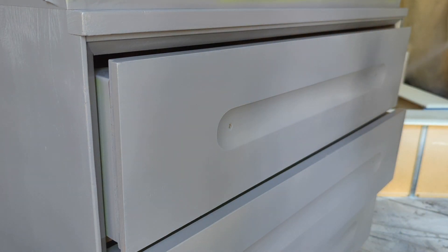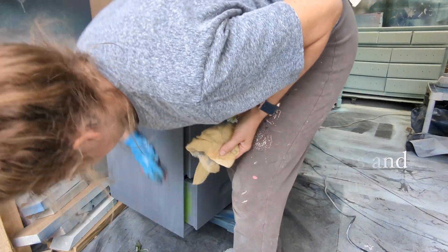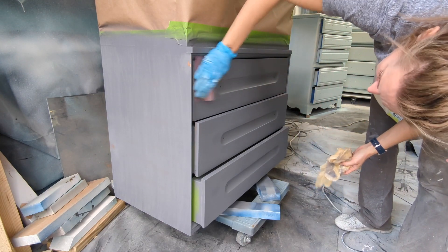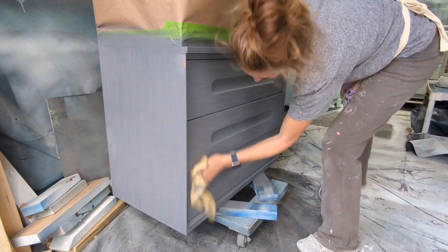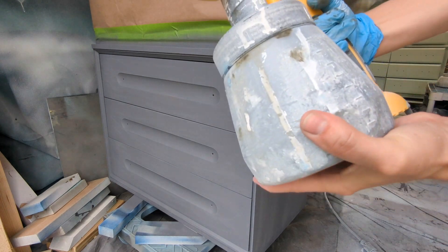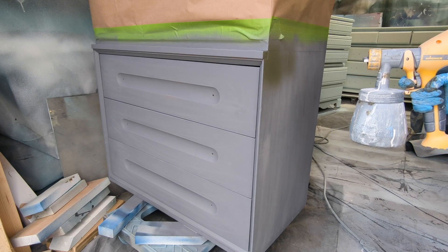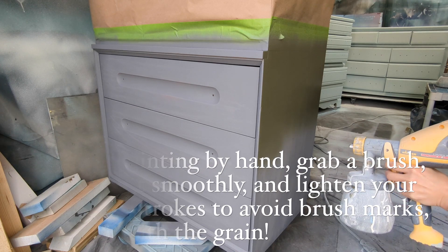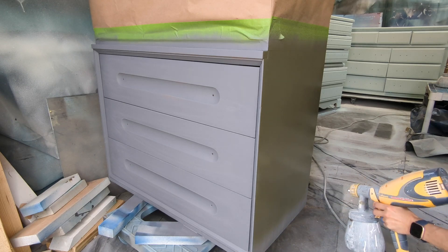If you're using this paint as a primer, buy it in matte. Sand any imperfections down and wipe with a tack cloth. I like roughing up my primer with a very light grit — think of it this way: lower grit scratches it up more, while a higher grit like 220 will more buff the surface. I'm using my double duty control sprayer so you can see that a $67 sprayer will get you this type of finish. You can also paint by hand — just use really soft brush strokes towards the end, going in the same direction as the grain.